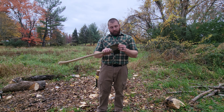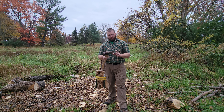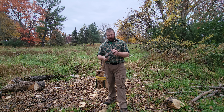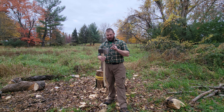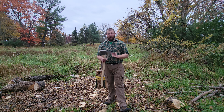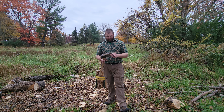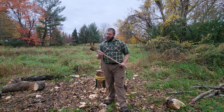Just got the FE6 ground down to about a 20-degree, generally flat — most of the flap disc. Haven't polished it up quite yet, and it's got a 20-degree micro bevel on it, so just under 20 for this. On my little bevel gauge it's 17 and a half and 20, somewhere in between there. I'm hoping to get the file out and make it more flat, kind of get a jig on there, but this is just going to be a test to see where I'm at. Looking pretty good so far — feels pretty good.